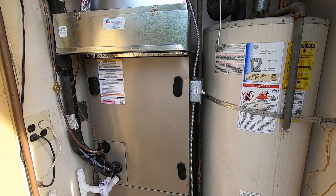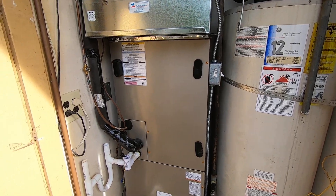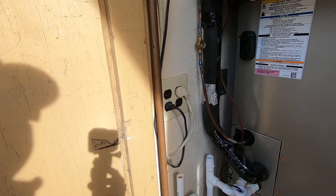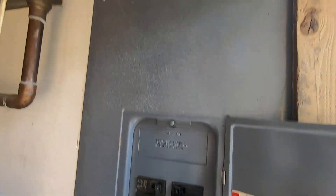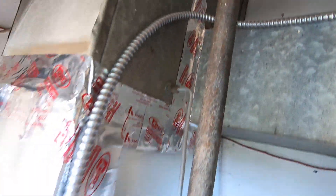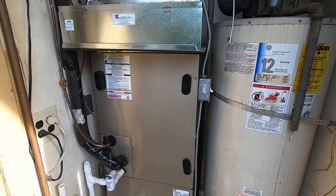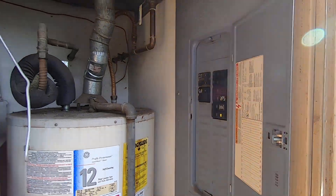To accomplish moving from a gas furnace to a fan coil, it uses 220-volt electrical instead of plugging into a 115-volt outlet like this. The furnace used to plug into this, but we can't do that anymore because this outlet is sharing many other things like plugs, lights, and other stuff. So we ran a dedicated circuit from this panel. It takes a 15-amp two-pole breaker. We ran it through this junction box right here, and you can see this line runs all the way down to our disconnect switch, which is a 220 switch, and that goes in to power the unit. We just ran a nice 14-gauge wire in there — it's not too big because it is so close to the unit.